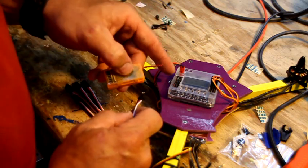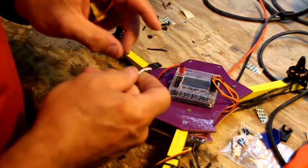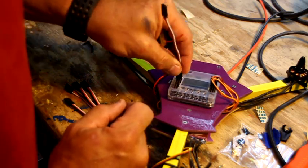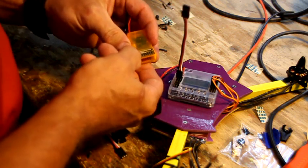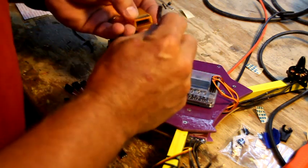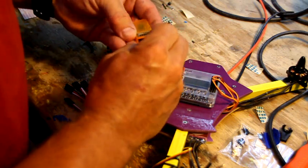Alright, the first on the left hand top is your aileron. See, I knew that from memory, not looking at another board sitting up on my desk. So white wire to the inside, that goes to aileron. You go to your receiver, you look on it, and mine says battery, throttle, AILE, A-I-L-E, aileron. So white wire on this one to the top. So you go 1, 2, 3, plug that into the aileron.